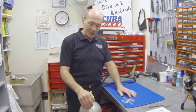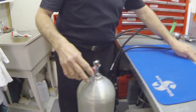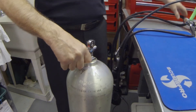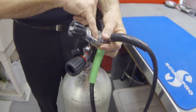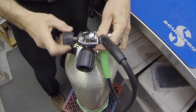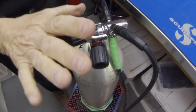Real simple. We have a standard scuba tank here, and we have a regulator. Let's put the two together properly and go dive. First of all, you take off that tape off the tank — don't throw it on the boat, don't throw it in the water. And a little burst of air just to be sure that the air outlet is not plugged up. Take your regulator and mount it properly by removing the dust cap and putting the regulator over — air going in, air goes out. Those two parts match, just goes like so, and snug the knob in there. Doesn't have to be too tight, just snugly. You guys with the big strong hands, go easy — just snugly like so.